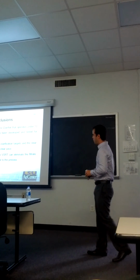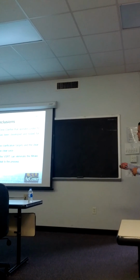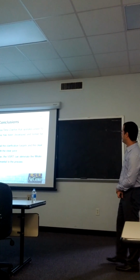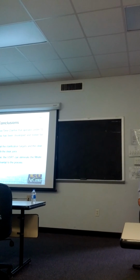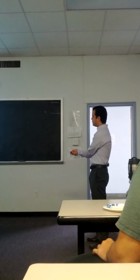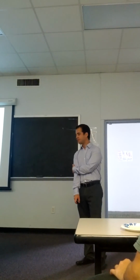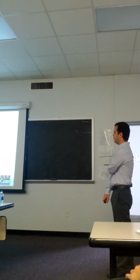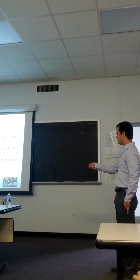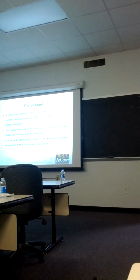I would like to finish my presentation by giving some final thoughts. A very short retention time clarifier that operates under 10 minutes residence time has been developed and tested for filtrate clarification. This clarifier achieves all the clarification targets, and the clear filtrate can be mixed with the clear juice. In a full-scale application, the very short retention time clarifier can eliminate this recirculation, which is detrimental to the process.